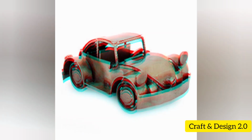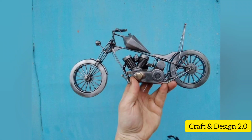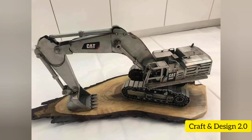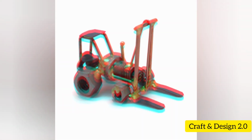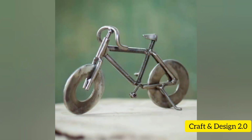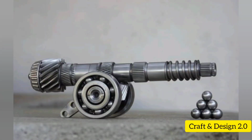A custom car is a great way to practice your welding and creating skills, something useful for outdoor and indoor home decor items. Using mild steel or stainless steel, you can cut the pieces into a desired shape with the angle grinder or the plasma cutter. After preparing the metal edges, use a TIG welder for clean welds or the MIG welder for faster assembly. Ensure proper penetration to make it durable and heat resistant. Once finished, apply high temperature paint or leave it to develop a natural patina for a rustic look. A beautiful character design not only enhances your welding skill but also makes a great addition to your indoor and outdoor home decor ideas.